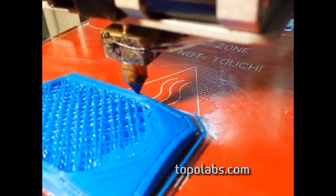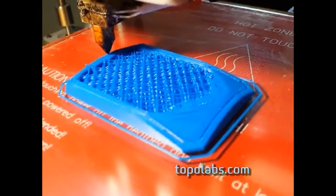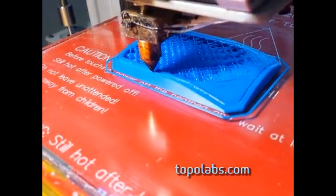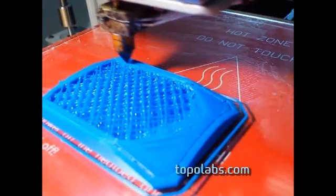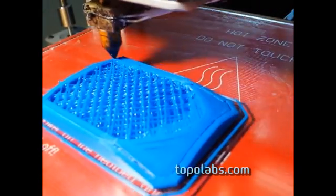Now the Topolabs style build with 3D toolpaths actually starts out with the system automatically generating any flat layers you need — for example, for steep sides, which is what it's printing now. Plus any support material that you might need in the middle. This is showing the flat sides and the support material being built at the same time.